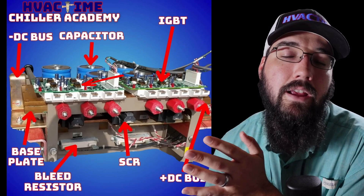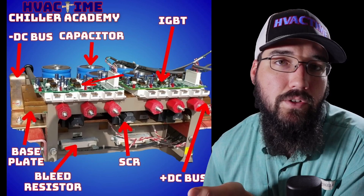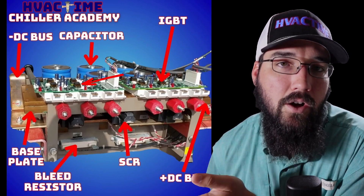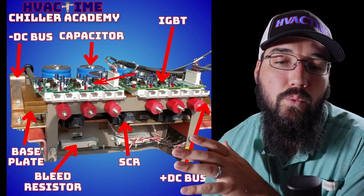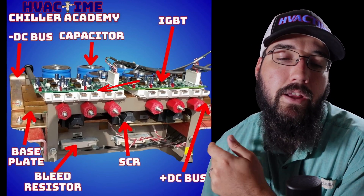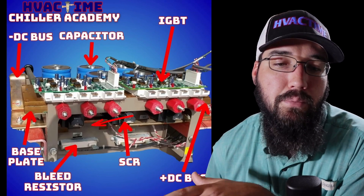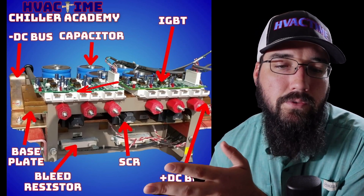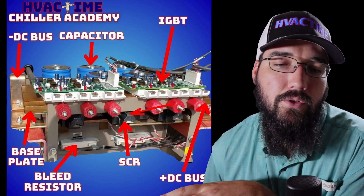The capacitors stabilize the DC side of the system, which then gets fed into our IGBTs. These IGBTs are inverters — they take that DC voltage feed coming into them and convert it into a pulse width modulated, or PWM, sine output. Our systems and components and filtering have gotten much better over the years. Used to be, on an oscilloscope, this was a fairly ugly sine wave, but now it looks much closer to resembling a pure sine wave from grid power.